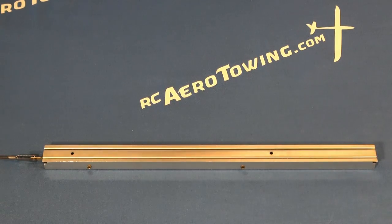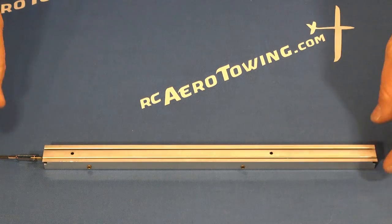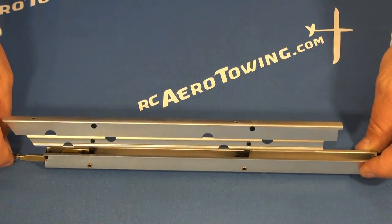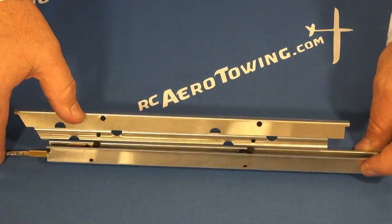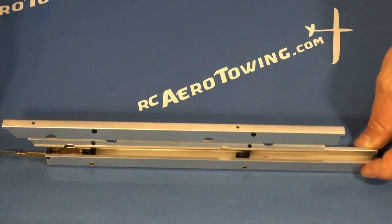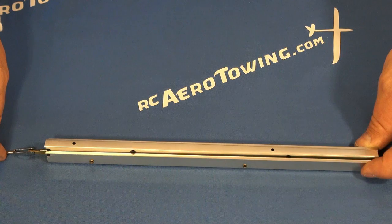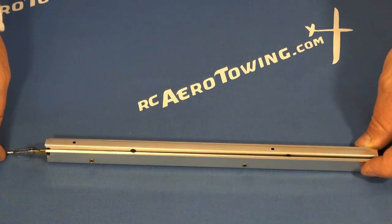We're going to talk about a few common mistakes and errors that happen with installation of spoilers, and also problems that will develop over the season of using spoilers. When the spoiler is deployed, it comes up into the wind stream and quite a bit of pressure gets pushed against it. So it's fairly common that they will, over time, start to snag just a little bit when you put them back into the slots.